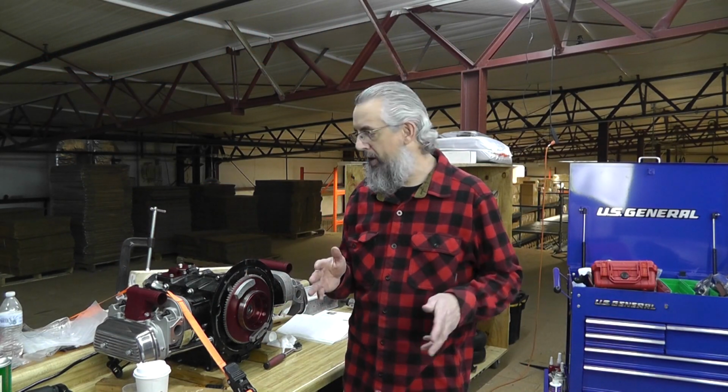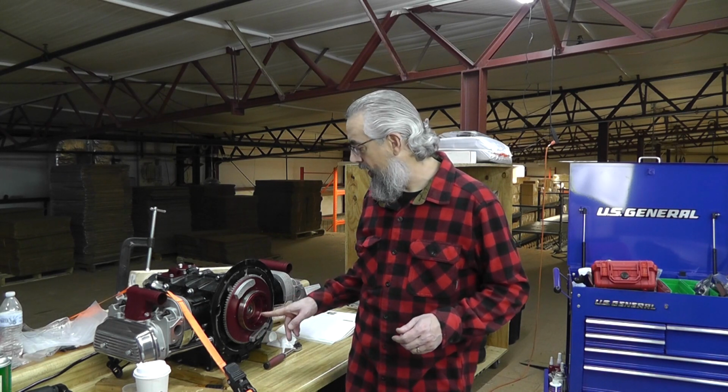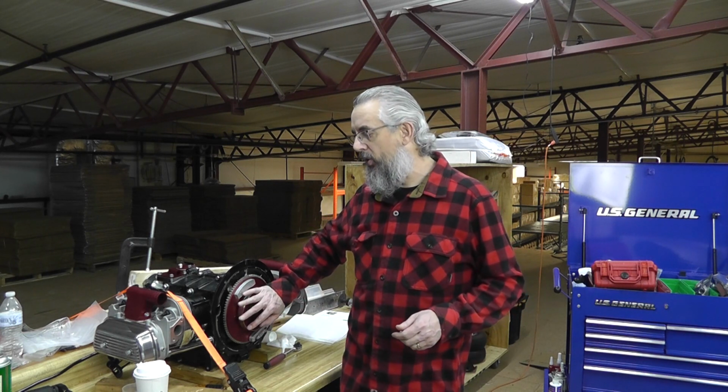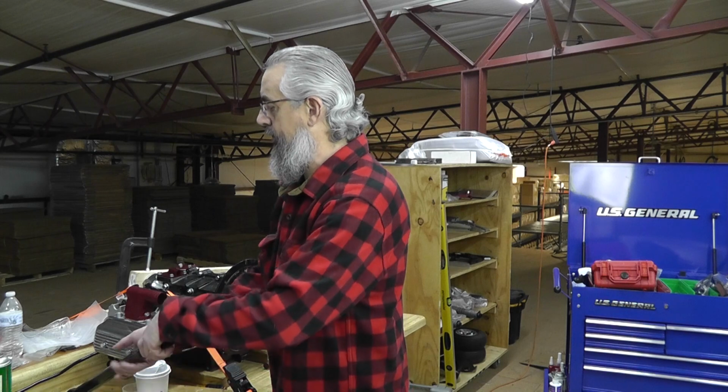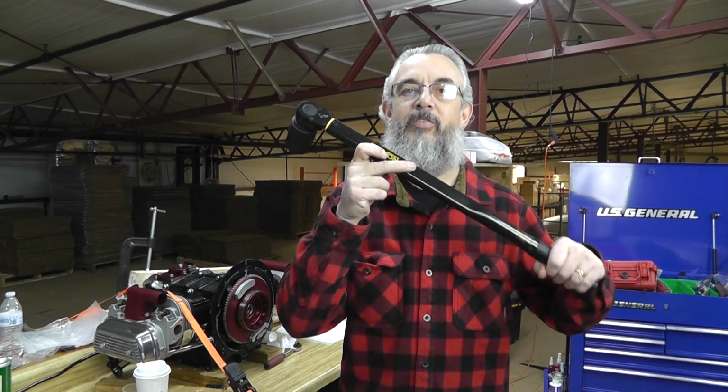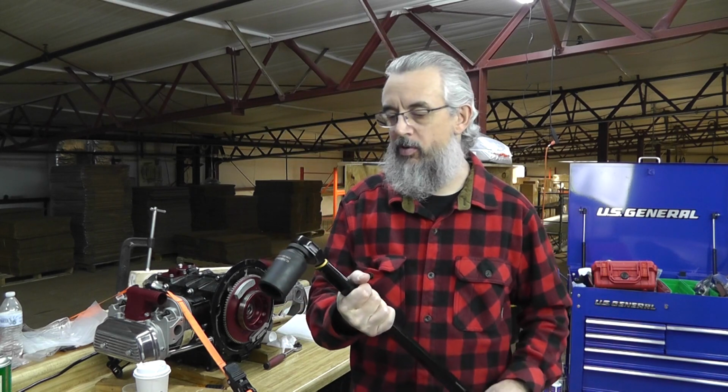Welcome back, everybody. When we last met, I was having trouble getting 227 foot-pounds of torque on the gland nut after installing the flywheel. So I went out and bought some 3/4-inch sockets to go on my fancy new 3/4-inch torque wrench.